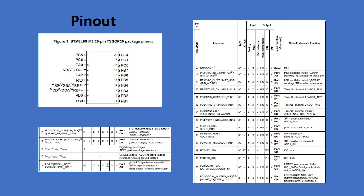So that's all I have. Data sheets and multimeters are probably your best friends in hardware hacking, because the data sheet tells you what the device does, and then you can use a multimeter to test if that circuit as a whole is functioning properly, or find out where you need to connect your pins to get the information you want. So, are there any questions?